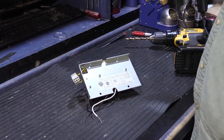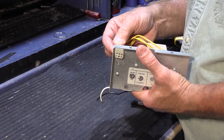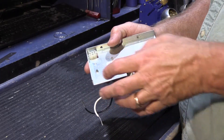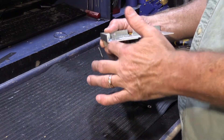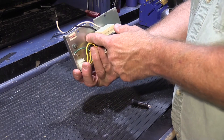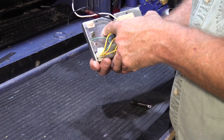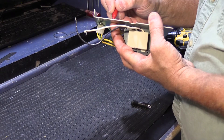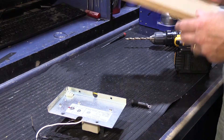Before I take the transformer off the mounting plate, I want to figure out where our fuse is going to go. This corner is where the plug sticks through and the mating half from the master station plugs in, so we can't use that area. We also have to account for the space available — we don't want it too close to the edge where it could accidentally contact the metal wall housing, which is grounded, and that would be bad. I think right about here gives us enough clearance on all sides. I'll mark it with my red marking pen — that's where our fuse holder is going.